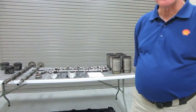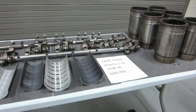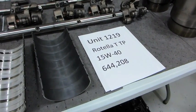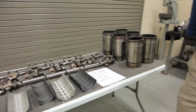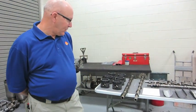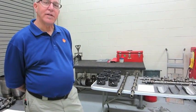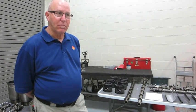We're here today involved in an inspection of three different trucks. The first one was a Rotella T triple protection, 644,000 miles on this 15W40 oil. The second unit was a Rotella T5 with a 3.5 high temp high shear, and the third is an experimental oil — a Rotella T5 10W30, but it has a 3.0 high temp high shear, which is below what's currently approved.